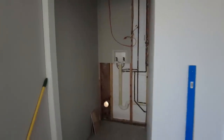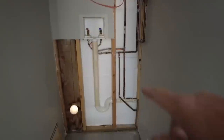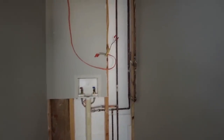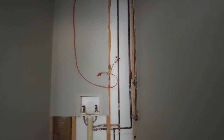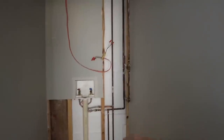I did get some pretty good progress made up there on the rental property, and I'll show you a little video footage right now. Here's what she looks like after a few hours of work. These walls are six inches thick — two by six walls. There's the regular two by six inch batting compressed against the outside wall. And then I put an inch and a half of styrofoam behind the main plumbing area here.